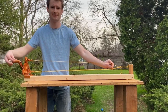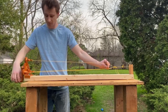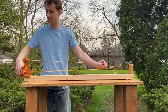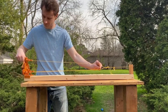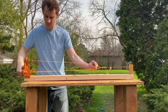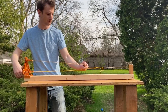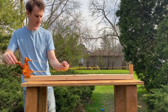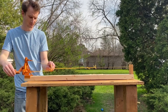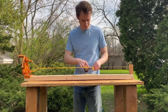There should be about 4 inches between the slider and where it's starting to twist the string together. Most professionally made rope is twisted counterclockwise; however in this video I twist it clockwise because I wasn't paying attention. As the rope starts to twist around itself, it'll start to move a little bit closer. You always need to make sure to keep the slider at the same spot relative to where the rope is twisting — it should slide forward on its own without the need to move it, just hold constant pressure.